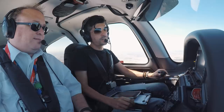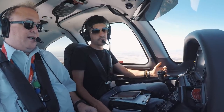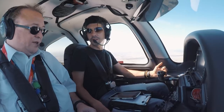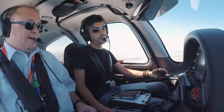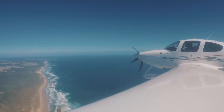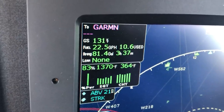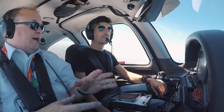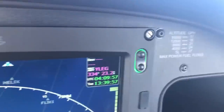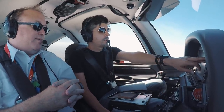Let's start climbing. I normally go to the engine page. I'm going to go full power, but I need to enrich the mixture first — nice and gentle. So the temps go up and start falling again as more fuel is added to the mixture. Fuel pump on for the climb. Then full power. I would have set my altitude before, but let's say we go up to eight and a half. I tend to stay on the map page because these values will be the hottest — so I'm not having to look over 12 values, only two.